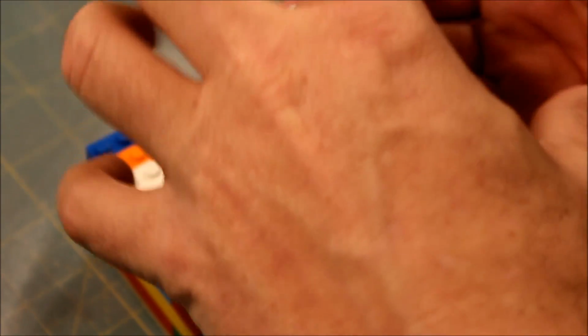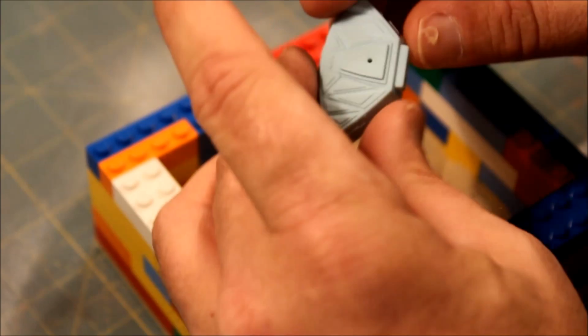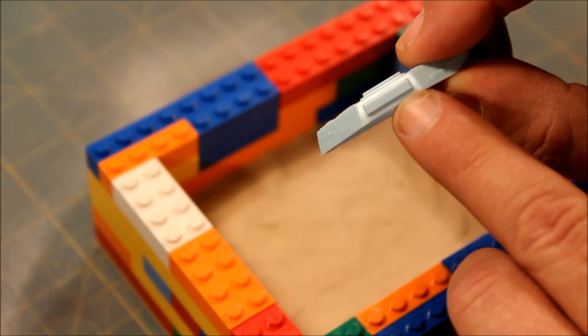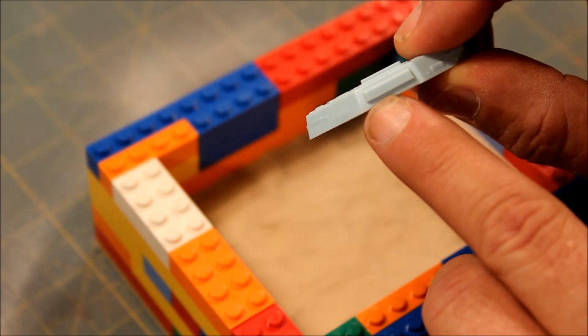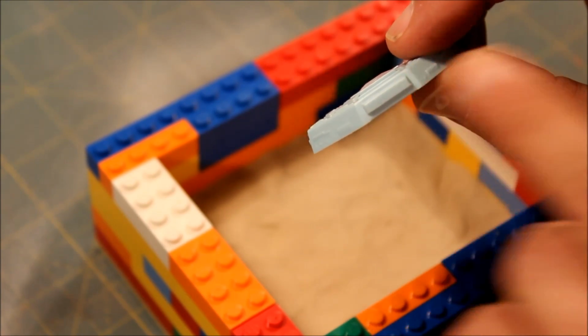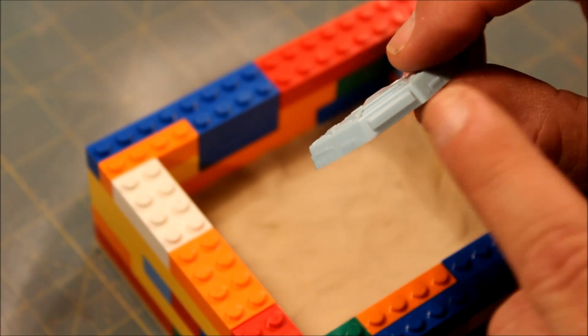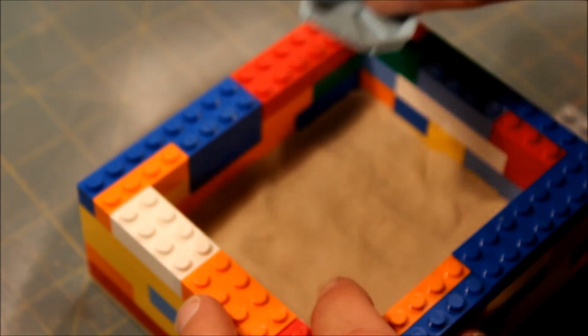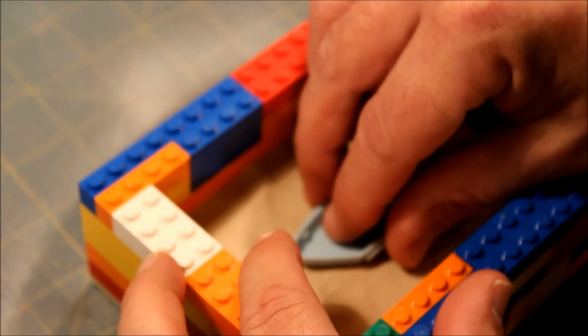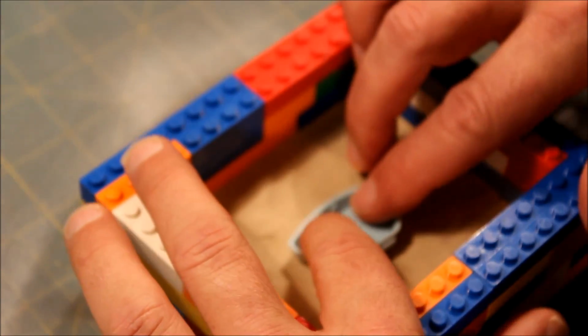We put the other mold on top of it. When we split the mold, it should be perfectly like this. And I'm going to use the back here to put where I'm going to insert the resin on one side, and on the other side is going to be the vent to push the air out. So without further ado, let's get this guy to where we want it in here.